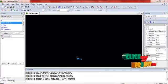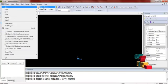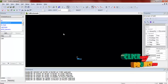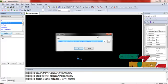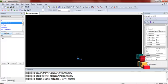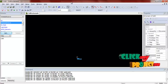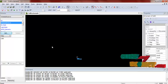We designed the circuit in Tanner version 13.0. To create a new project, you have to click on File and then click on New and then give the new design. Then to add the library files, you have to click on Add and then give OK to add these components. Then for the new cell, you have to click on Cell and then give New View and specify the name you want to give to your design cell.